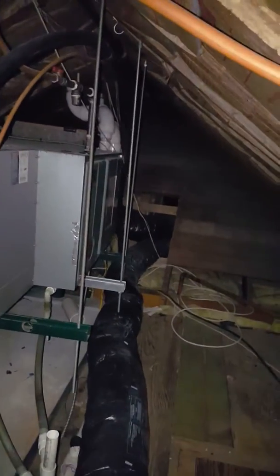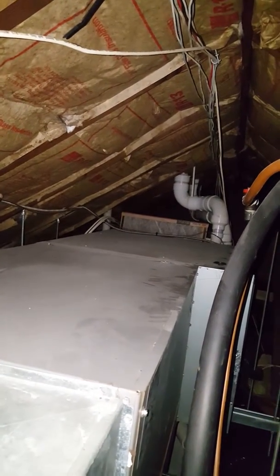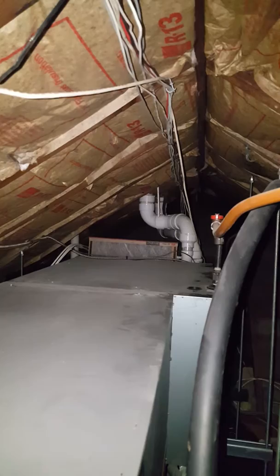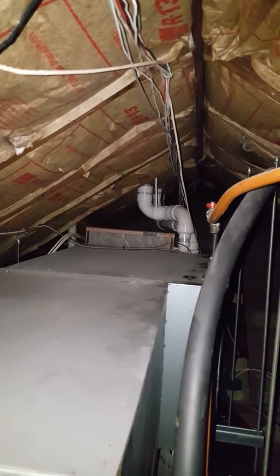Currently there's a PVC-vented furnace in place and we're going to go back with a PVC-vented furnace. As you can see, it's got three-inch PVC — that noise is the fan motor — and we actually reduce it down to two-inch before it goes through the roof, so we'll probably end up doing everything in two-inch. I'll put a note on there if we need to do anything different.